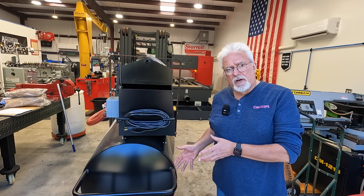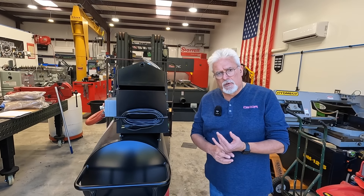We're going to clean out the sump cleaner. You should do that whenever you're changing coolants, or if you've cleaned a real dirty sump and you've got bacteria issues — it's good practice to clean this out before you move on so you don't cross-contaminate. This particular unit has fork pockets, and we've lifted the sump cleaner up so we're not on the floor trying to clean it out. I normally start on one side and open a wing nut. You can see the coolant — there's probably an inch or two on the bottom of the sump, and we do that as another slight filtration of fines. With this, if your reservoir was too small, you can shut it off real quick by just tightening back up.